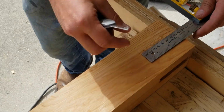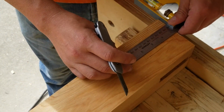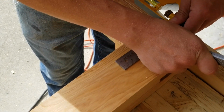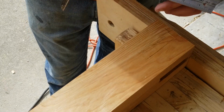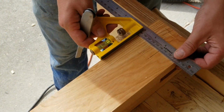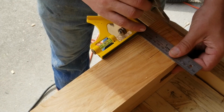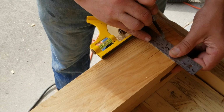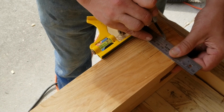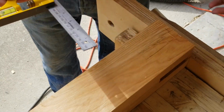While editing the last video, I realized that the stretchers along the top of the table legs needed to be more of a haunched tenon to protect that upper edge. So even though I've already got my mortises laid out, I'm doing a mid-course correction here and laying out new lines for the mortises. I'll then chop each of the mortises with the new game plan. I think it made for a better overall joint, especially on these longer stretchers.